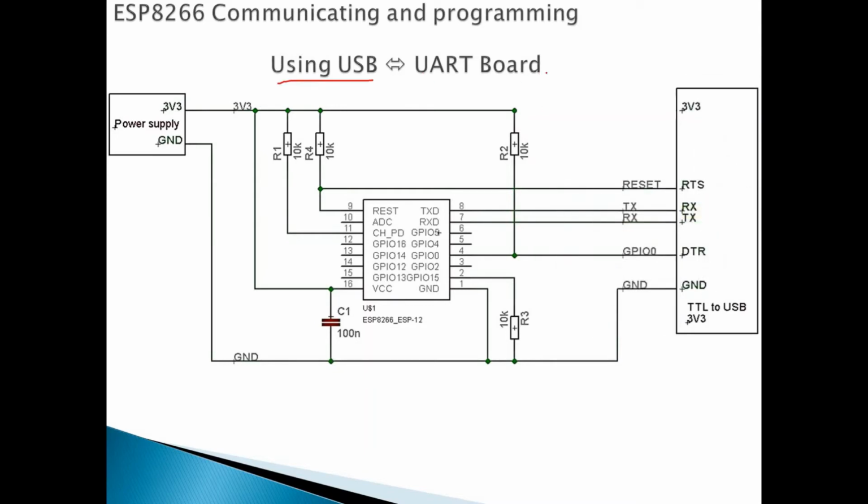Pointer pen. Okay. So this port is this, and this is the 8266. Okay. And this one is the external power supply. Again, it's very recommended to use an external power supply. And here the supporting capacitor, the filtering and supporting capacitor could be, here they use 100 nanofarad. For me, I would use about 220 to 400 microfarad extra. Okay.